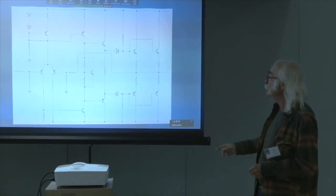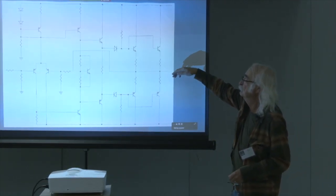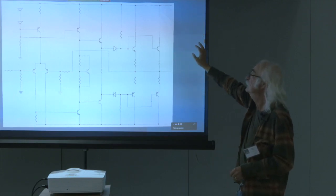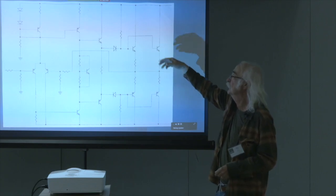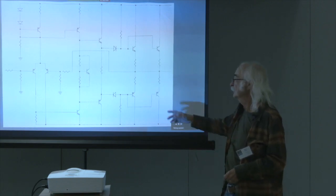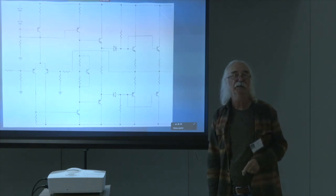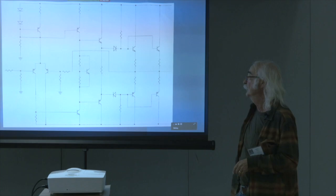Well, let's say the amp's going positive, and this one side is delivering all the current. Well, if that's the case, then there's no problem. The diode's in full conduction there, and there's no issues. Down here, however, normally these guys would be shutting off. Well, instead of having them shut off, I decided it was better if the fast little stupid diode did the shutting off, because there's very little time associated with that event.